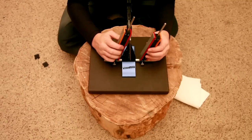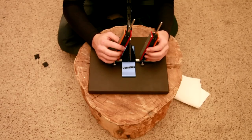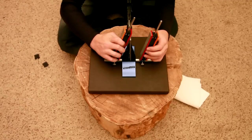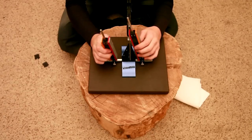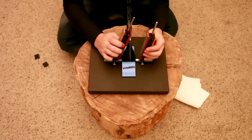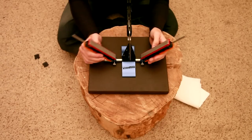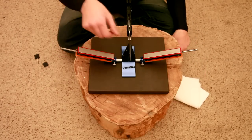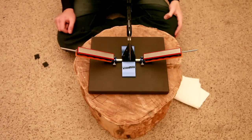I know you can do the scrubbing thing. Chad's alright with that. I'm not. I prefer to just do slow stroke by stroke, making sure I'm keeping the stone in line with the bevel, and making sure I can feel it cut all the way down. Go by feel with the hundreds until we feel that we're not cutting as much on the bevel. It's sort of a by feel thing. There's also, you can test it like various people have said, by running a Q-tip up each side and down each side, and just trying to see when you've got it real symmetric.